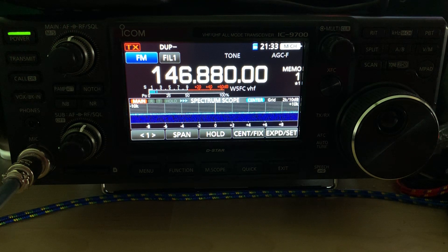KG5EIU. Today I'm going to show you a short movie on how to hook your ICOM 9700 up to PiStar on a Raspberry Pi in terminal mode. Terminal mode enables you to make gateway calls through the internet using PiStar running version 4, and you need to hook the Raspberry Pi to the ICOM 9700 via the optional OPC-2350LU cable kit.